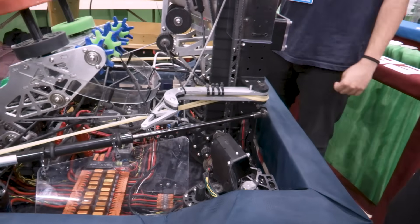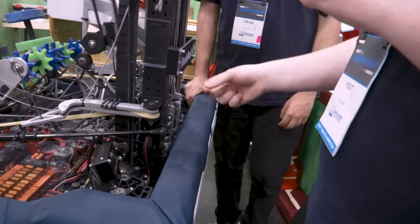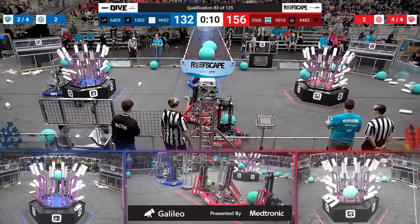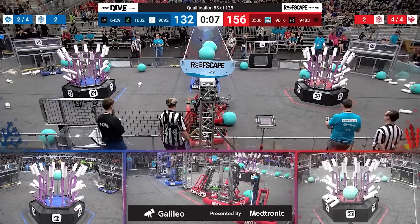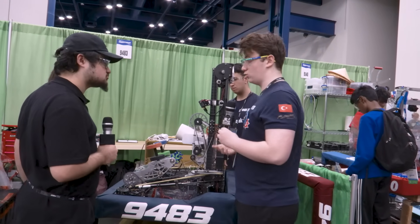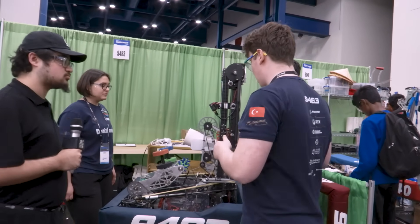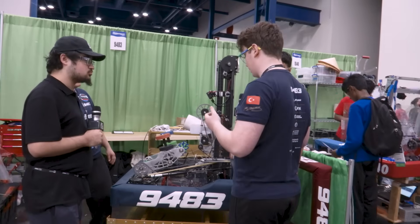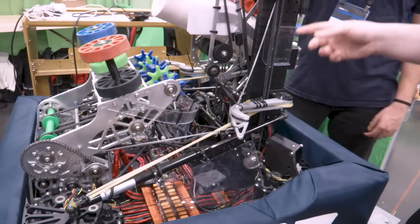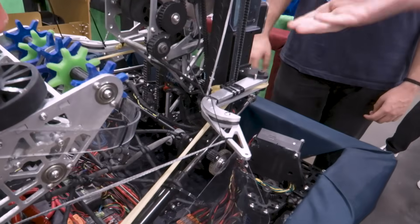We have two Krakens used for the climb system. We have a deep climb. When climbing, we open our intake and close our elevator system onto our chassis so the ropes get stretched and the zip ties break, allowing our claws to grip the cage. Then we pull it toward ourselves and the lower side of the cage gets stuck to the bumper, which helps us climb. The design came from thinking through our strategy — we wanted a deep climb for more points and realized we could close the elevator onto the chassis, grip the cage, and pull it onto us, so we just did it.